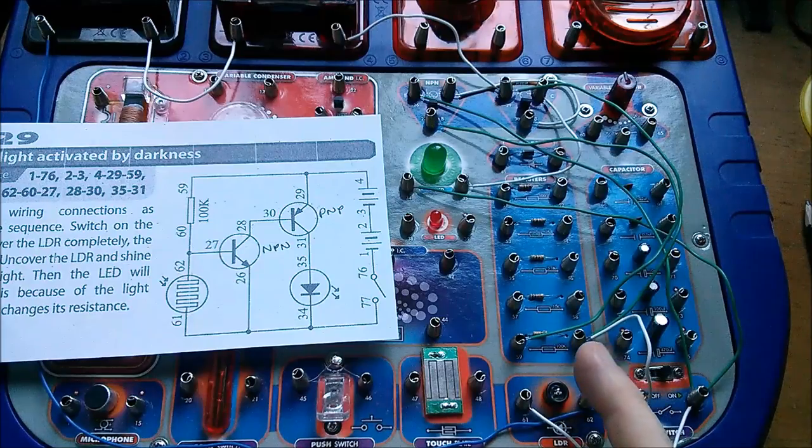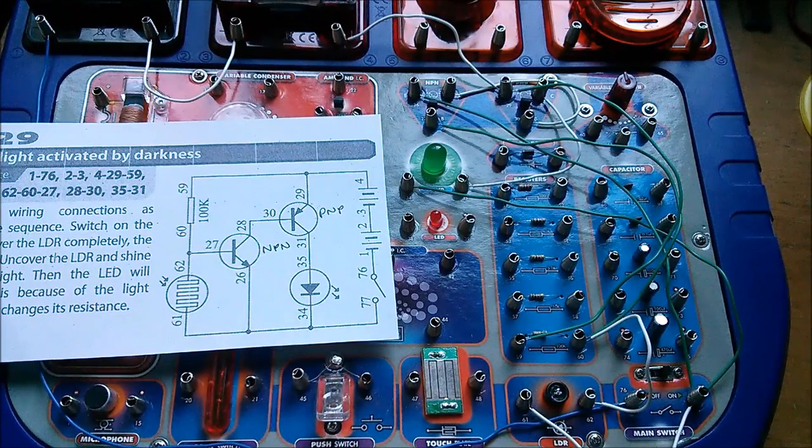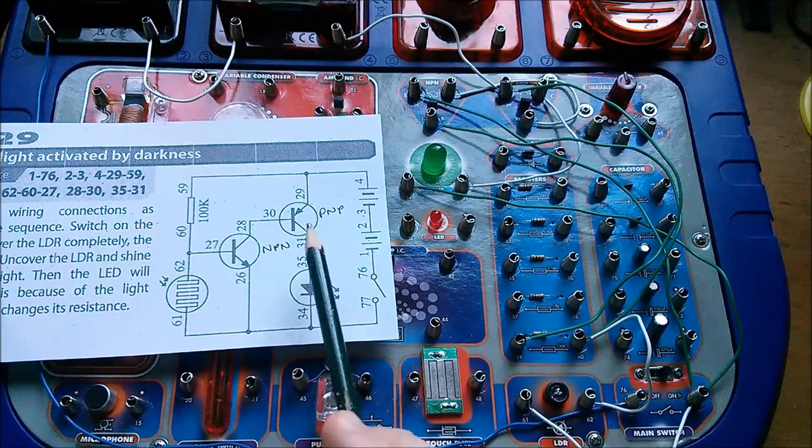This circuit works — I don't have to block that much, and in fact there's a very fast transition. Although I can control the power to that LED, the change in light level is very tiny, so it switches rapidly from the off state to the fully on state. I'm pretty certain that's the purpose of that second transistor.